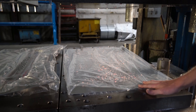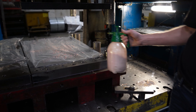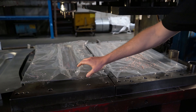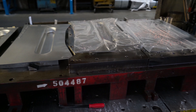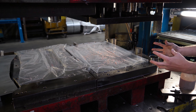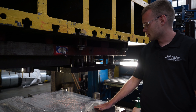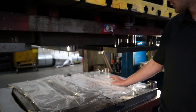We start out with a flat blank that's going to be bagged. As you can see, there is draw lubricant on these blanks. In the first station there's a deep draw where it takes this flat piece of sheet metal and turns it into a cup shape inside it. The draw lubricant reduces the friction between the pressure pads and allows the material to flow. Per the customer's orders, we're not supposed to have lube on the finished part, which is why we're bagging the blanks.